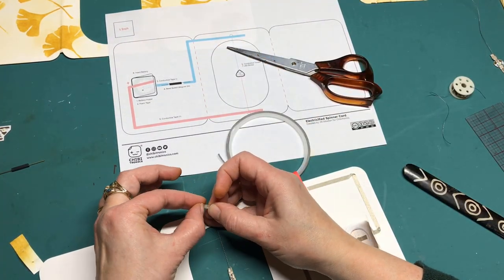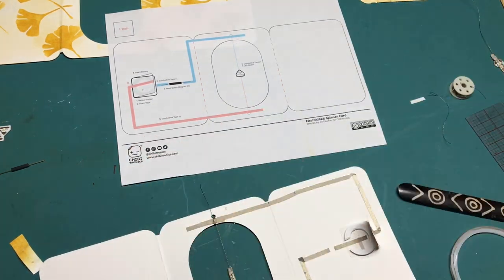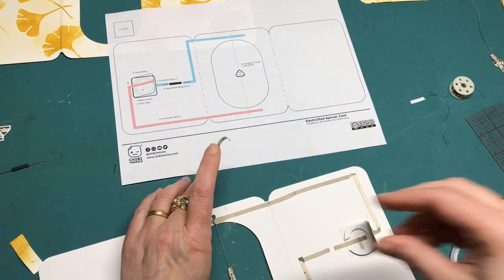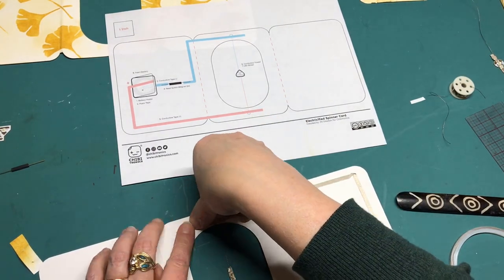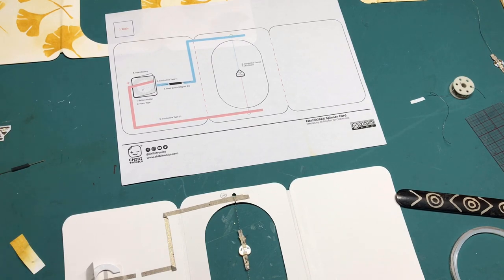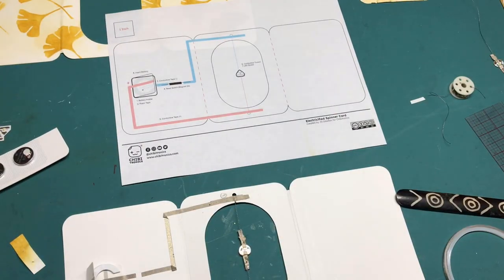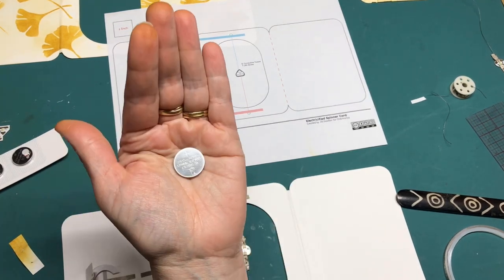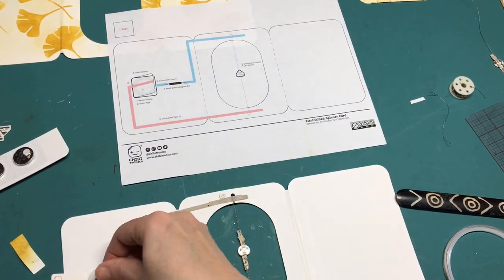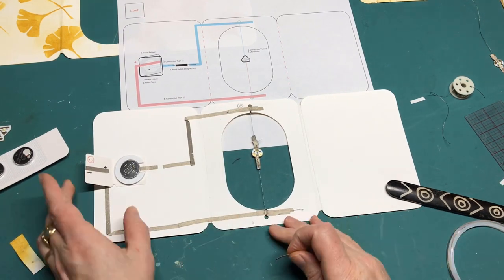Once your LEDs are sewn into place, go ahead and add your battery negative side down to the battery holder. I'm using a single CR2032, but you can substitute two thinner CR2016s into the holder for the same fit. To test the circuit, close the flap of the battery holder door on top of the battery and hold a piece of conductive fabric tape over the switch gap.